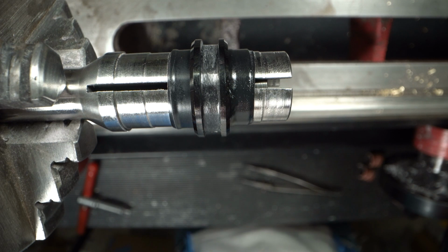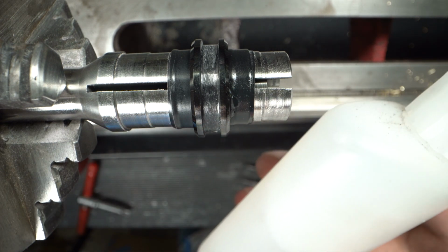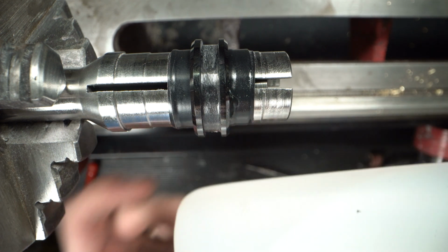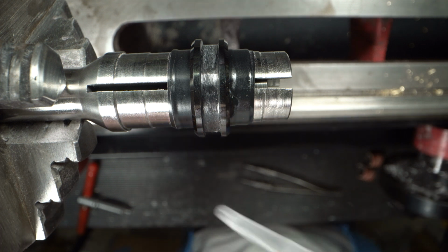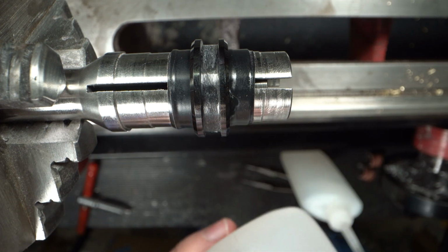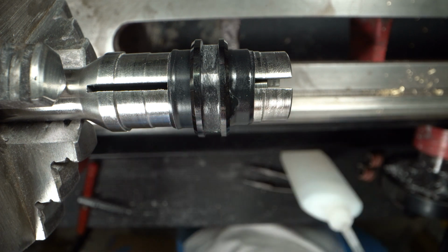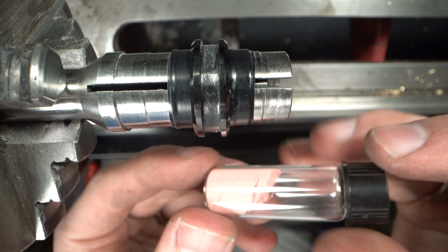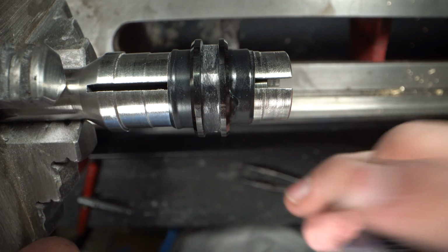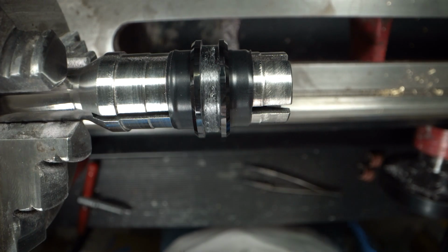Okay, now from here it's going to be pretty straightforward. I'm going to be using a combination of my medium viscosity super glue and my ultra thin here. Between the two I'll be able to fill in any voids. This gets stuff in place, and then the super thin is able to seep into any cracks or pockets and make sure that you don't have any holes in the ring. Now I just need to go through, inlay this all throughout the channel, then we'll grind it down, polish it up, and we should be done.